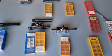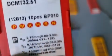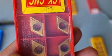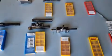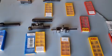The ones that are going to cost you more money — because you're going to get three times less usage — are the diamond shape. The designation on the back reads DCMT 11T304, so there's the code for it. They come in different formats where the chip breaker and radius are different, and you can get into tighter spots with them — that's one of the best advantages. But you're only going to get two uses out of that.